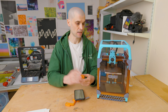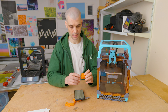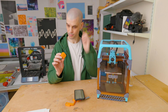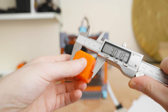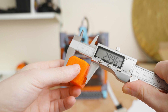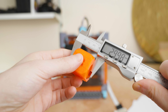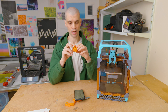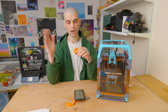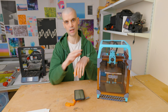Following the manual, you'll get to the stage where you calibrate the printer. I calibrated the Z offset, manually leveled the bed, then printed a Voron calibration cube — and I was pretty much blown away. The cube is meant to be 30mm × 30mm × 30mm, and it came out within 0.08 millimeters. I thought I'd be spending a whole day tweaking belts and counting steps on the stepper motors, but if you just follow the steps in the manual, the LDO kit prints perfectly right out of the box.